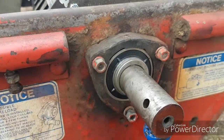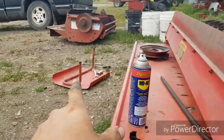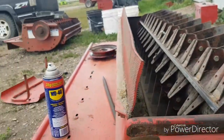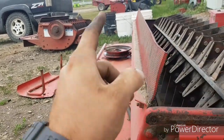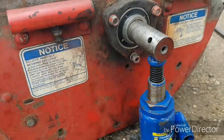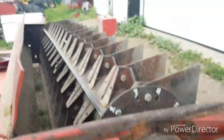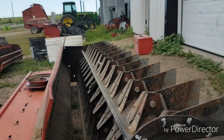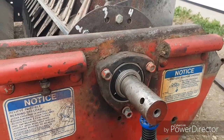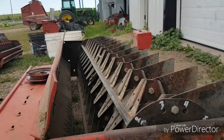So I had to pillage a pillow block off of that chopper. I also got the shield and the handle for this side because this chopper was missing it. I've got to tighten these up, put the lock collar on, and then the pulley goes on this side as well. I'm not going to get anything too tight just yet because I've got to make sure I've got things centered.